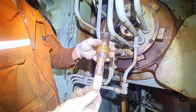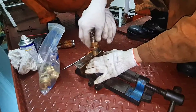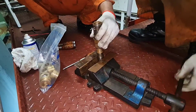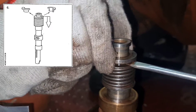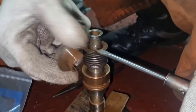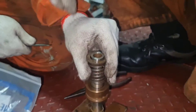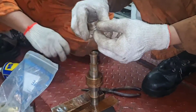I found that the upper liner and slide valve clearance was large. Press in the spring and remove the locking rings. Remove the upper spring guide, the spring, the lower spring guide and the upper liner from the slide valve.